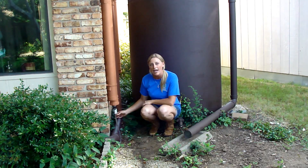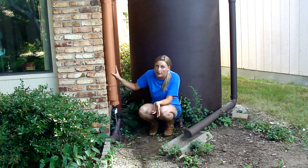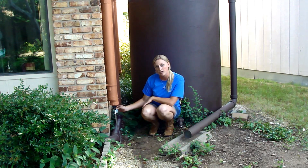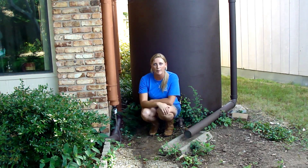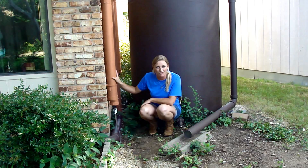This couple actually decided to use this water. As I said, it's not bad water — it's just the dirtiest water — but it can still be used. They hooked a poly line up to the slow release nipple and have it running out into their flower beds. Since it's maintenance free, it will drain itself out and be ready for the next rain.